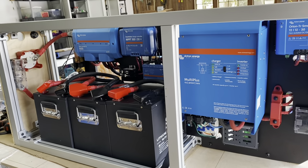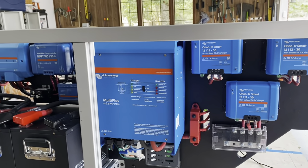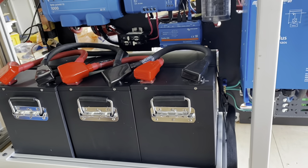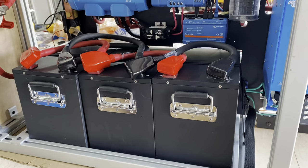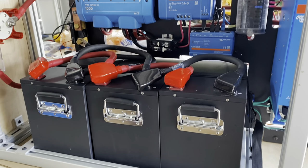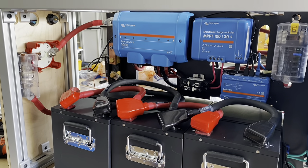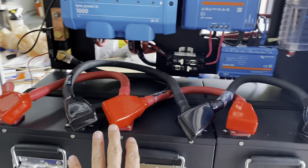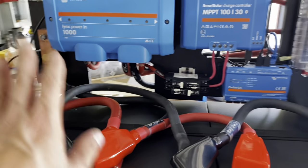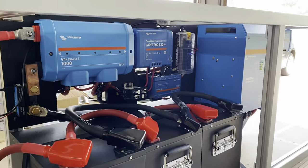I'm super excited — we are just about done with the electrical cabinet. A little disclaimer: these are three 206 amp-hour lithium iron phosphate batteries from CATL, a very popular battery at this point. These carry a tremendous amount of energy each, and this is only set up to be a 12-volt system. If you're thinking about doing this yourself, make sure you get some training, do some reading, and be super careful even when connecting these cables. I've got a 600-amp fuse, but if these cables were to fly out and touch anything, you could potentially get a serious situation. So full disclaimer — be really careful.